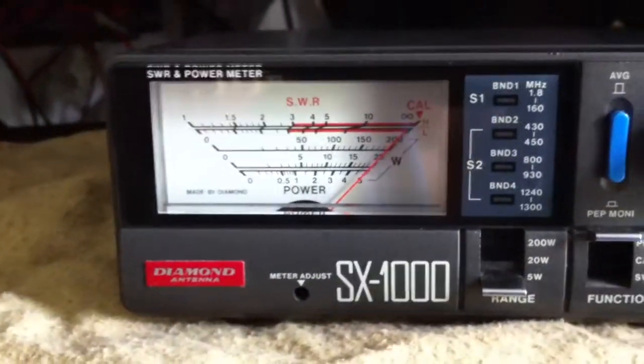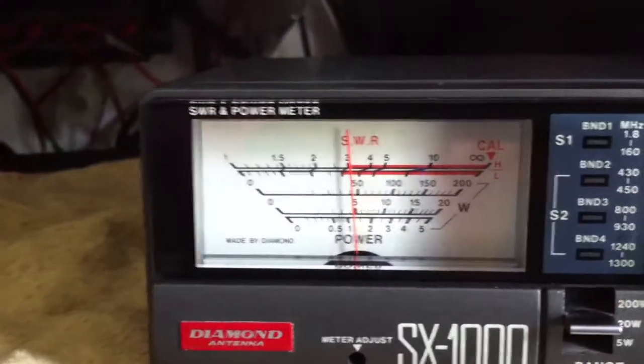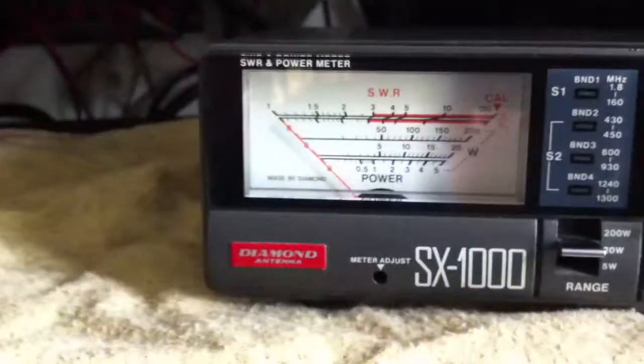That's interesting — so that's 5 watts again. We'll dekey, we'll just move up to 20 watts on here and we've got 5 watts, and we have 5 watts on here. So now it's working again — you can see the intermittency of this. And we've lost it again. If I key up again it's gone. And that was — you count it — 5 seconds, 10 seconds.